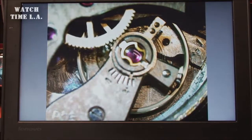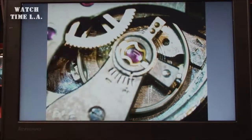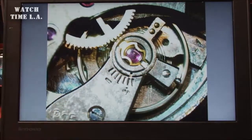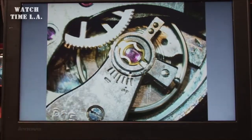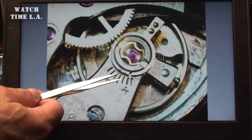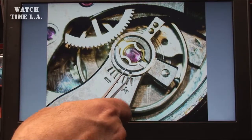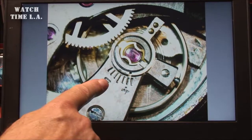Remember, all of these things are on different planes, and we're talking about stuff that's really, really tiny. So now that this is in focus, this isn't — we're talking about millimeters in height. There's your second hand. You ever see when they say adjusted or non-adjusted? Well, this particular one looks like somebody adjusted it, because normally these will be close to the center. And when they adjust them, if they're really calculating and adjusting them right, these will normally only come out one or two notches on either side — they're never really brought all the way to the end. But this is how you would make the watch run faster or make the watch run slower.